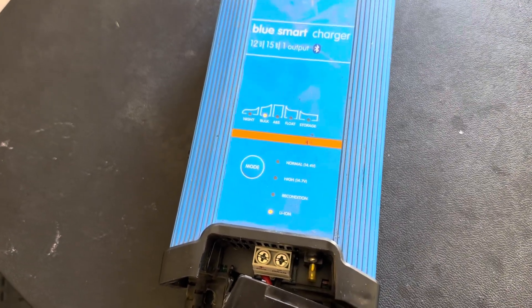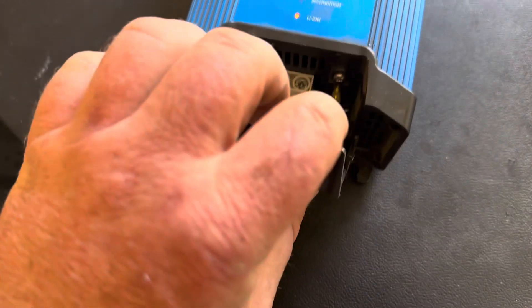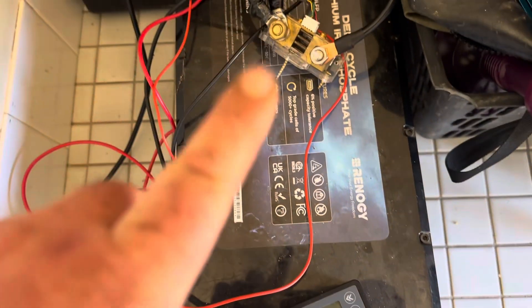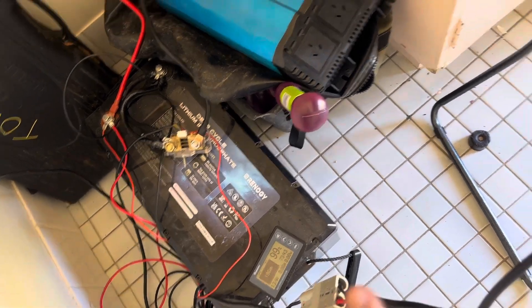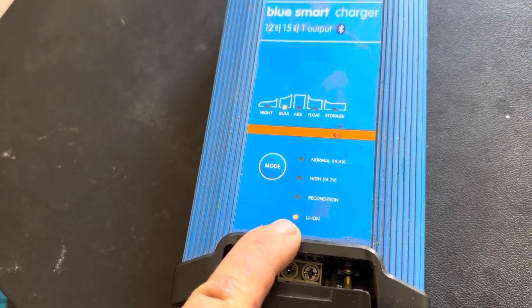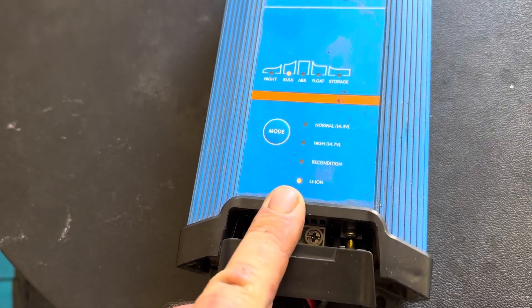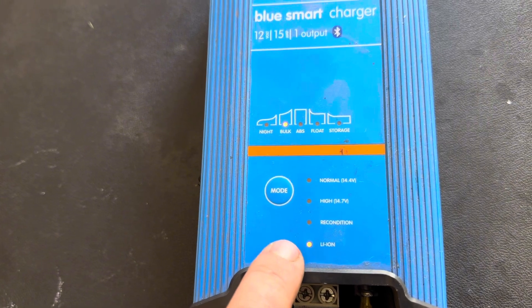As we connect up to the battery, I've got it set on battery charge — we were doing some testing before with induction so it's back on bulk charge. Because I haven't got the battery charger linked to the shunt negative, it's not getting the correct input voltage. We've also been having issues with our battery monitor even with things connected to the negative. At the moment it's set on lithium ion, which is about 13.2 volts at 15 amps. Depending on your battery, you can set it higher at 13.6 volts, with a bulk charge of 14.6 volts, reducing down to 13.6 once it's finished.